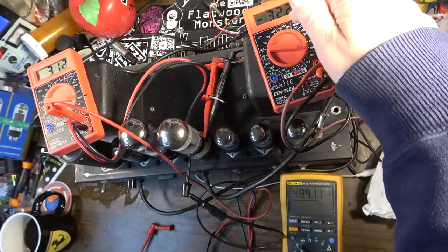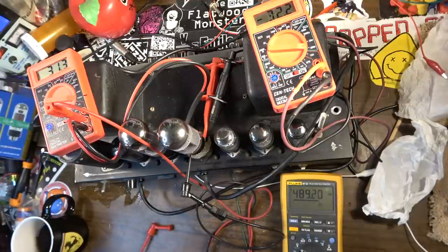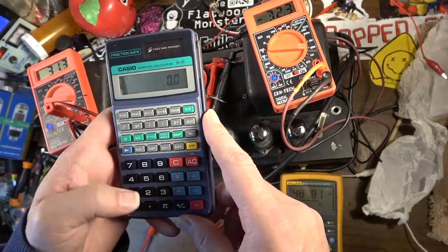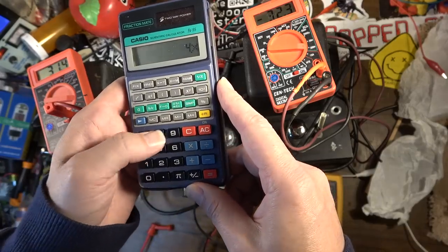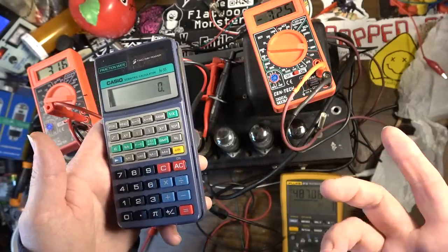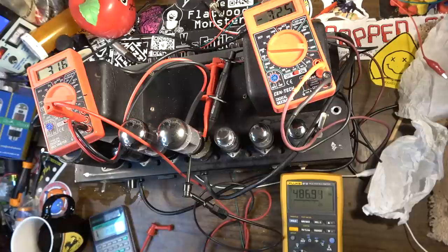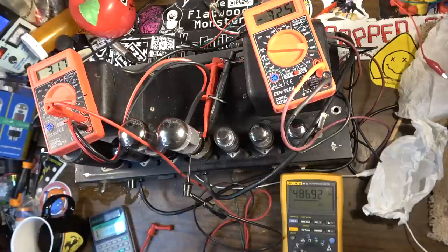So we've got 32.2 over here and 31.3 over there at 489 volts. So let's get our calculator out. Okay, so 0.0313 times 487 equals 15.221. That's kind of our 70% on 6L6 GCs, but 15 watts is probably pretty good. The 5881s, I'm really curious. Let's power this thing down and let's pop the 5881s back in there and see what those are biasing at.